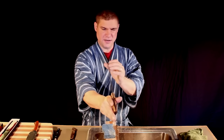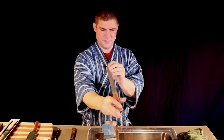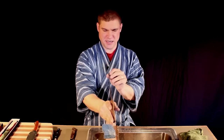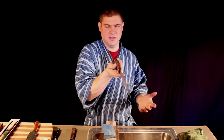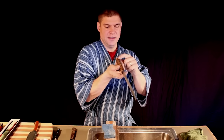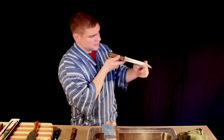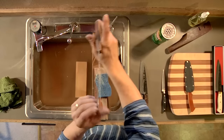And we were looking at it with the spine of the blade up, with the tip towards you, and then the edge up, tip towards you. The reason why we're doing it with the tip towards me is because if you look at a blade like this, like you commonly see people do, the fundamental problem is that what my eye can see is from the end of the handle to this point right here. You know what that means? That means that the rest of the blade was out of my view. And that's why we always do it point towards us.